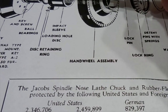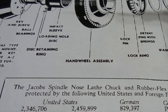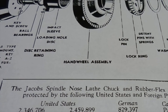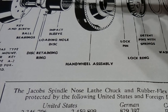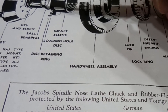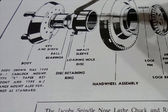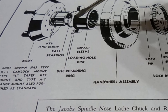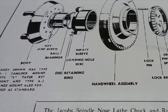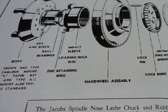There are ball bearings that go around this — they fit into this race and into a race inside here. There's a race here on this, which is a D13 in my case, and they fit into this. These were just gummy and gooey — it's never been maintained. Got that apart and started giving it a good look.